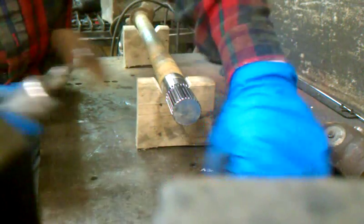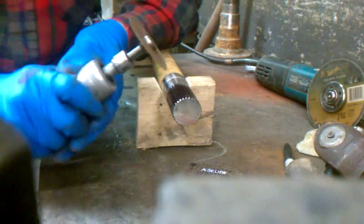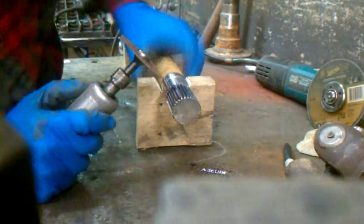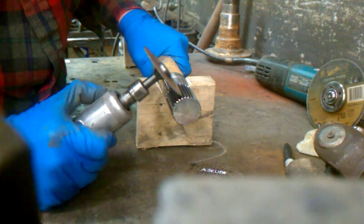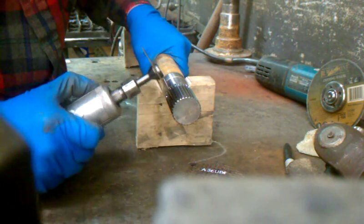We've got to fix that. I just use a — I think this is a 30-thousandths, this has got a 60 on it — I can use this or this, whatever's handy. Some Z-blocks just to keep your things lined up. If you're trying to go for the root, go right down the middle, make it deeper. If you've got a tooth that's a little wider, you can put it over on the side. It's 30 degrees. Then you come around and do that side.